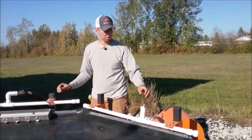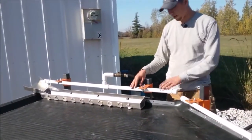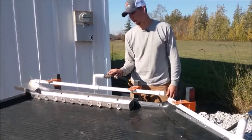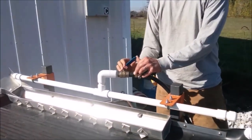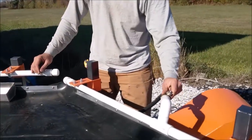There are two water bars on the shaker table — one over the cleaning plane and one over the distributor trough. They're made of PVC so they're very easy to replace if damaged or broken. The only adjustment on the water bars is these valves, which can be adjusted to tune the amount of water on the shaker table both for the distributor trough and for the cleaning plane.